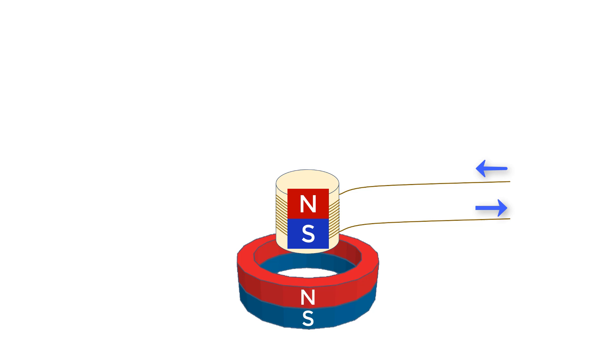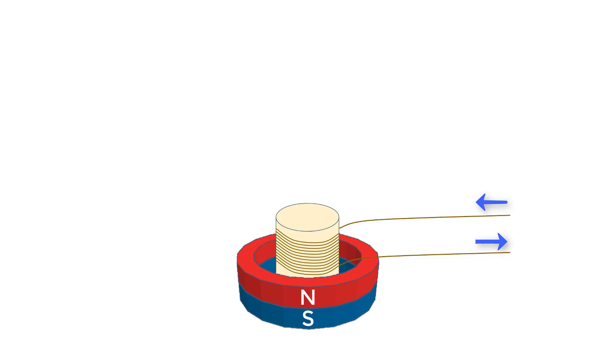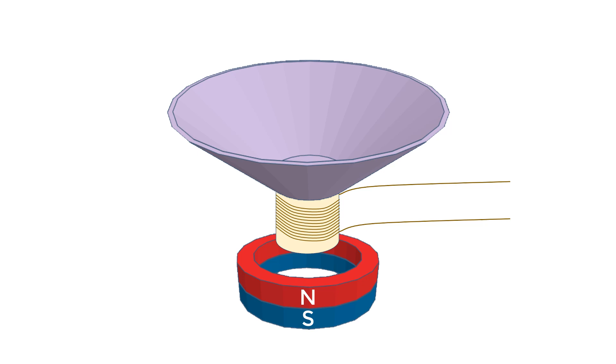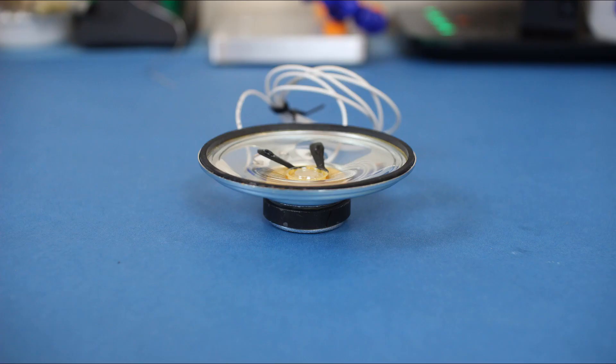And like permanent magnets, opposite poles will attract, which means the voice coil will move toward the magnet. If we switch the direction of the electric current, the poles on the electromagnet will swap. Now we have the same poles facing each other, so the voice coil will be repelled away from the permanent magnet. To use this motion to create sound, we add a cone of paper, wood, plastic, metal, or some other material to create a sort of diaphragm. As we switch the electric current back and forth, the voice coil moves in and out of the permanent magnet, which moves the diaphragm. This rapid back and forth motion creates pressure waves in the air, and we call these pressure waves sound.